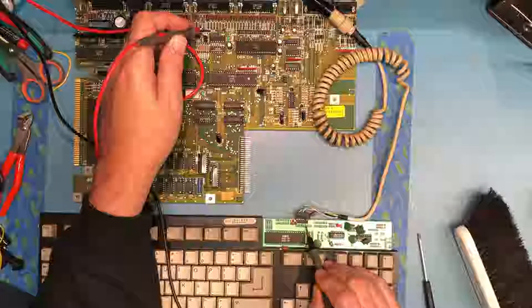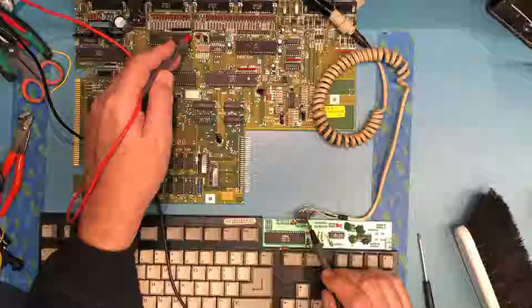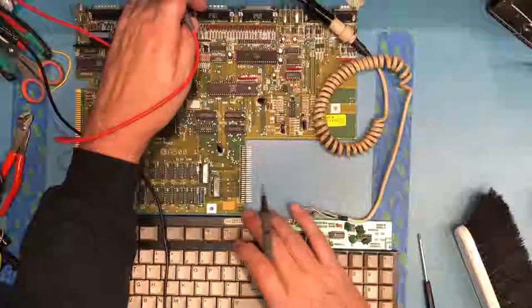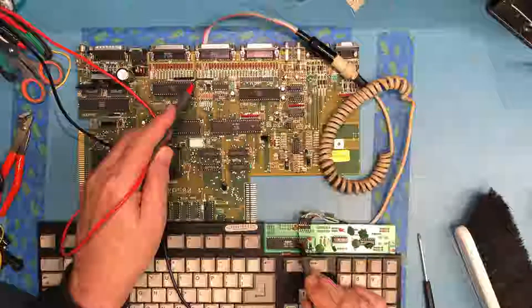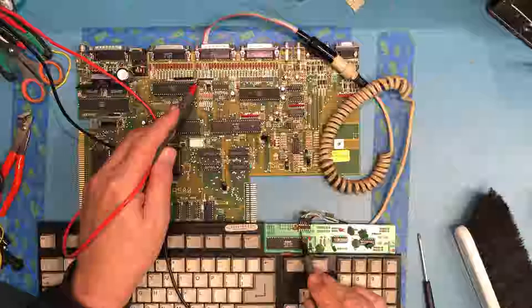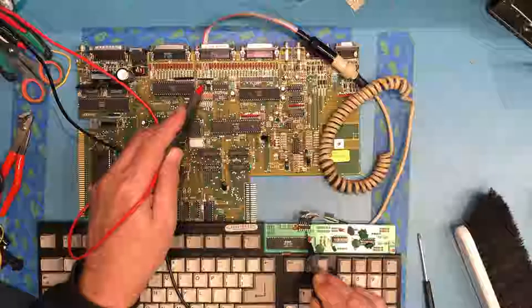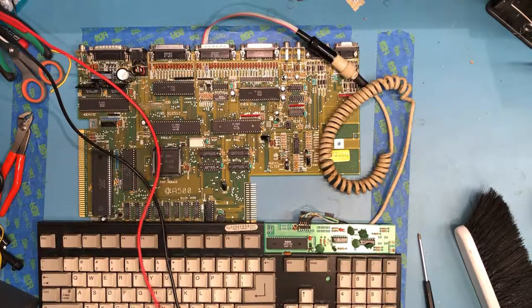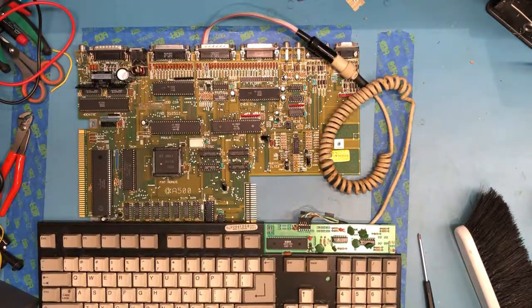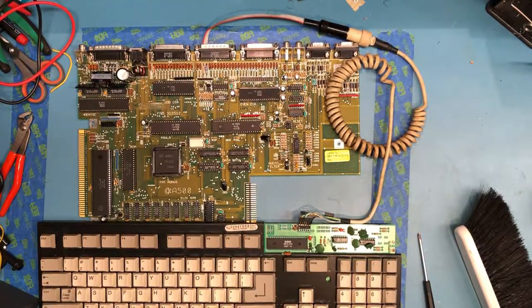So, this really does say to me that this connector follows the same pinout as what's on the motherboard here. The motherboard's got pin 1 marked. This probably isn't in frame. It probably won't show up well. The motherboard's got pin 1 marked here, and there's a dot here on the connector to indicate one. But I do believe at this point, I could just build up a cable that was one-to-one. And of course, I need to bring the two LED pins across as well. That would be one-to-one and would allow me to use this keyboard without this ugly kludge here that we put on. So I think I'm going to go ahead and tackle that.